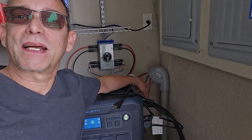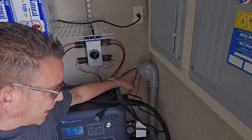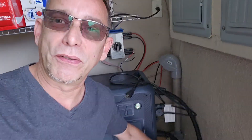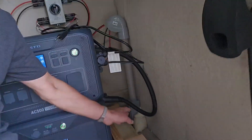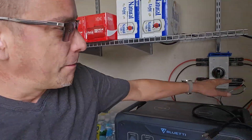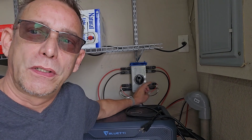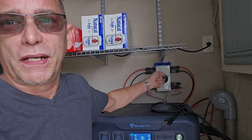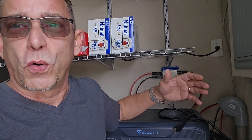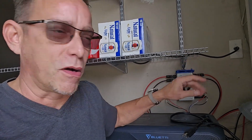In here I've got the same type of setup with a weatherproof cover where the wires come out so nothing gets down into that tubing. I also used Great Stuff heavy-duty foam — fills up to three-inch crevices — and I still need to shave that off. The PV solar wires come out of there. I've got four wires total — two positives and two negatives — going into this emergency cutoff switch, so I can cut them off either here in the garage or out back.